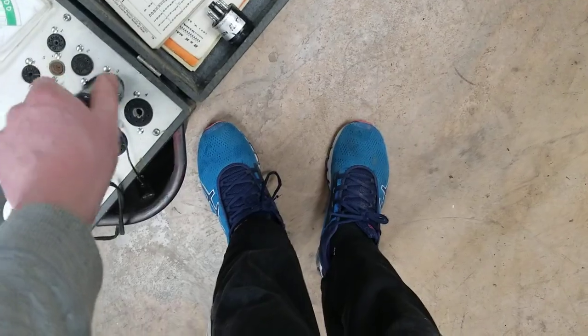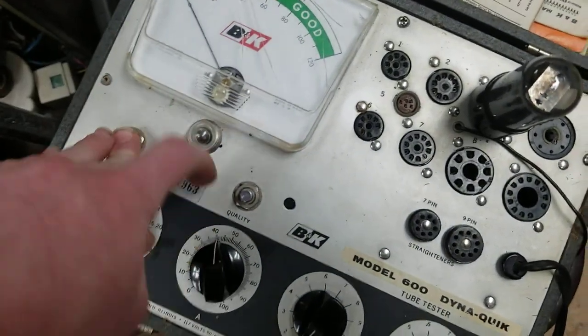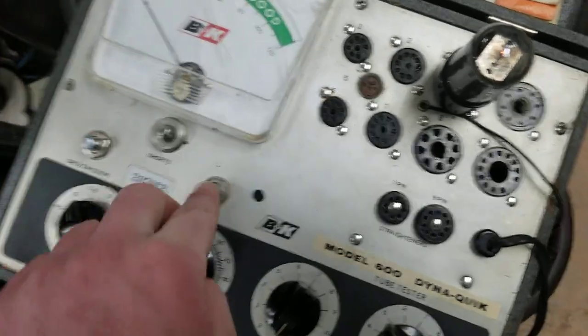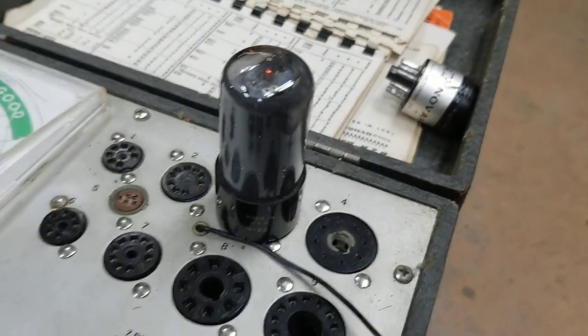So we're gonna pop this in the tube tester. You can see, I was doing it earlier, but the grid leakage would come up to here after about a minute of sitting, but it has good emissions. So it's trash, I can't use it, so let's just...